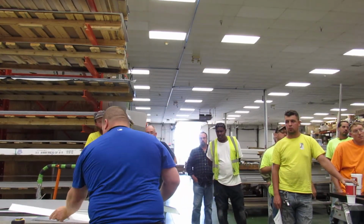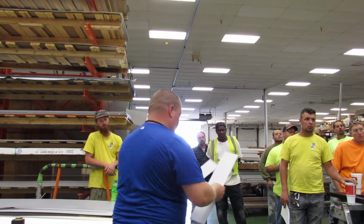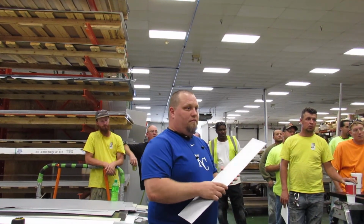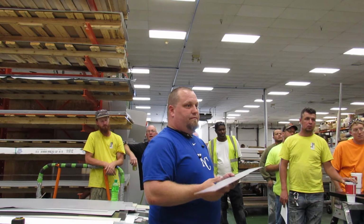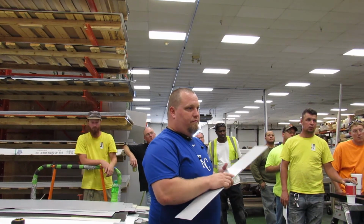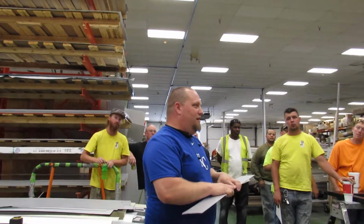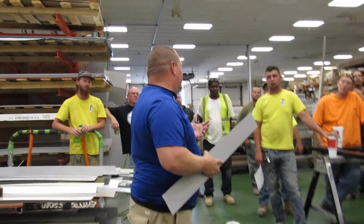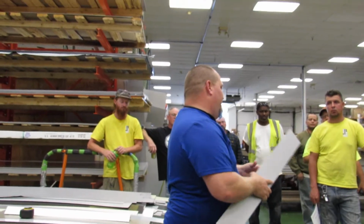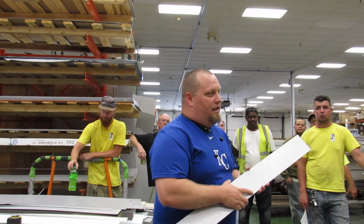Because otherwise, especially on the south side of the building, and we've seen it, and I've torn a lot of it off, that metal expands a lot. I've gone out to a job where a 10-foot piece of metal was bowed almost a foot up in the air. I use that as an example when we talk about how much aluminum expands in the heat and cold. I was wondering, do we really have to have that much extra room at the head, the caulk joint, this or that?